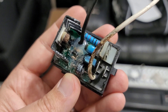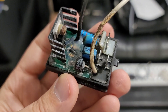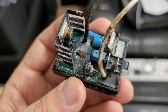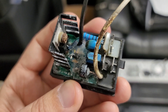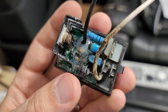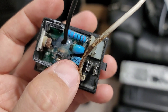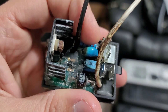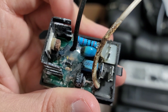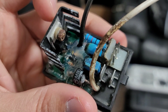I did go ahead and repair the board off camera. I wanted to get this back to James as soon as possible and as you can see there's quite a bit of damage. I've never seen this much damage on this particular board before. I can only imagine it was either an overload condition or something grounded out against the frame, because the only parts that were actually still good were this large diode, the capacitor here which is 100 nanofarads, and this metal oxide varistor which only conducts when the voltage goes over a certain threshold and then shorts it out. I believe what happened was simply an overload or a short circuit.